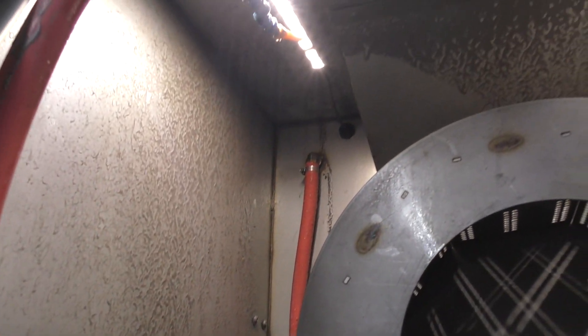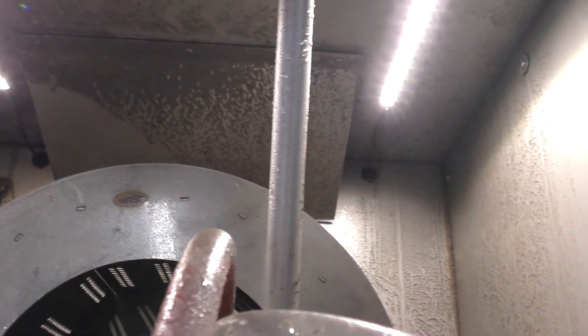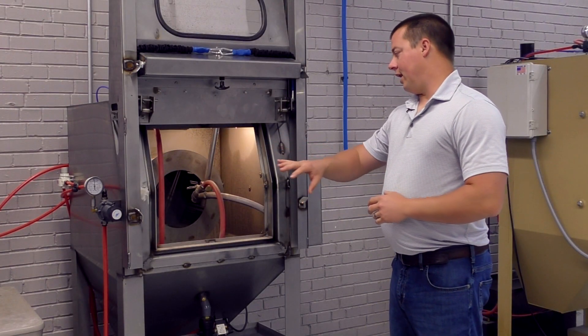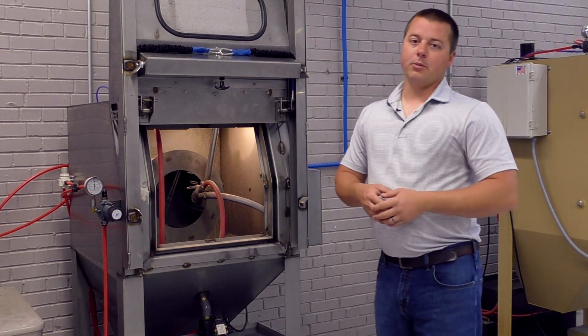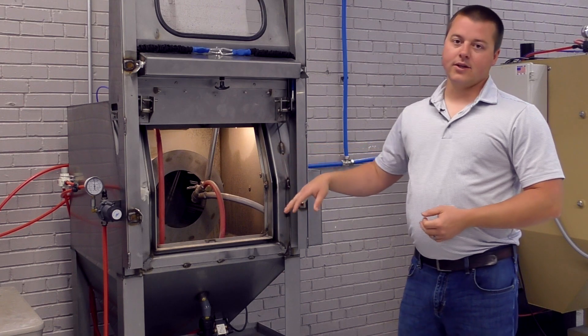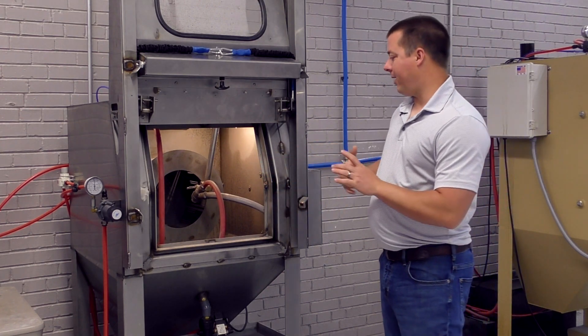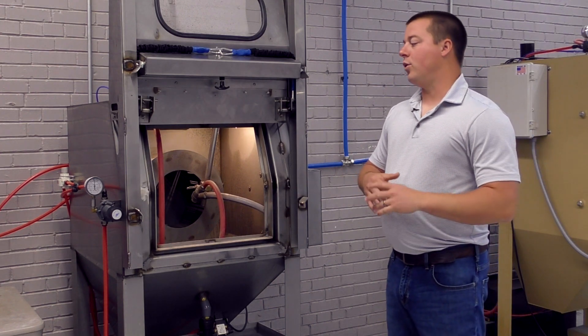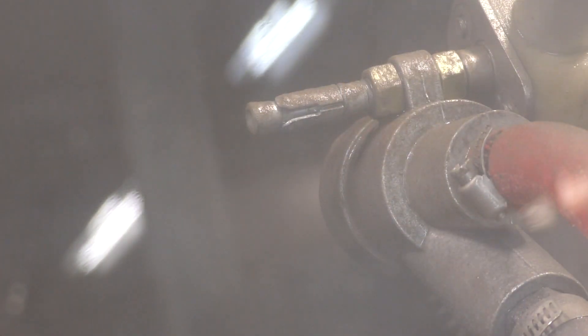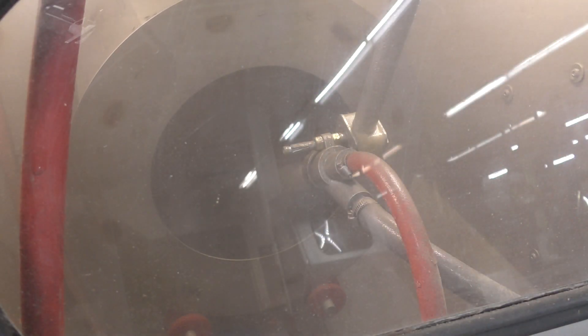Super fast — a lot of the stainless steel laser-cut parts we're running, I would say within four to five minutes we have the burr removed and a very consistent finish on the part. We were also doing some testing last night removing powder coat from smaller fittings — running about 15 minutes and about half the powder coating was removed. If you've removed powder coating before, you know how tough that is, but the repeat exposure and grinding effect inside the basket makes all the difference.